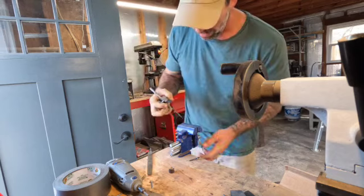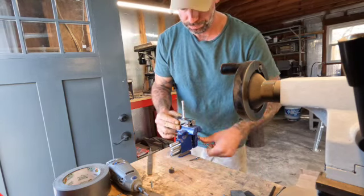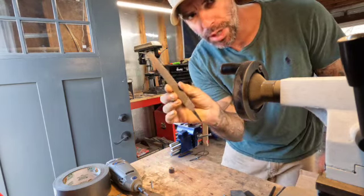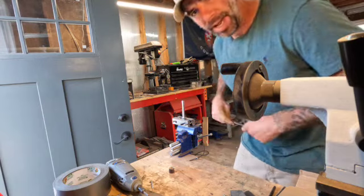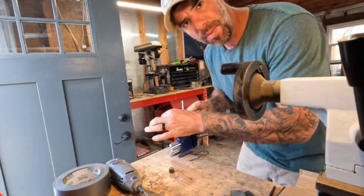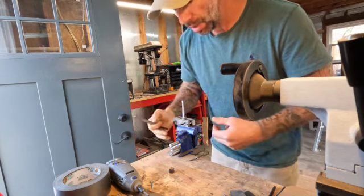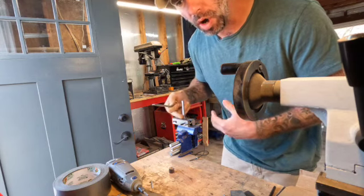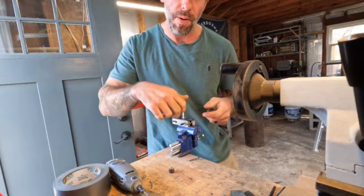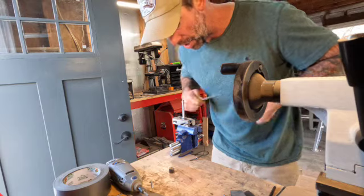All right, so I'm gonna stick this here in the vise, like such, clamp it down, and we're gonna do a lot of hand filing. Like I said, this keeps the bolster flush in this jig. As you take away material, you can see where you're at as far as the sides of your bolsters are. You want all those bolster sides of the knife to be nice and flush, for when it's time to put your handle on, it'll slide right on there and there's no gaps.